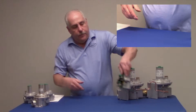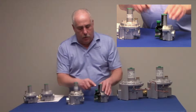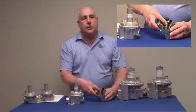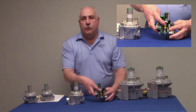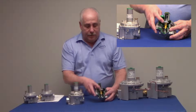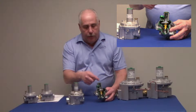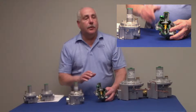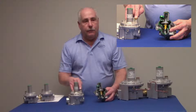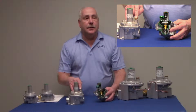The dual diaphragm, using either the external vent limiter or outside venting, gives you extra protection. If the first diaphragm ever ruptures, you have a second diaphragm with a small pinhole leak in it, which will allow the pressure to bleed off at a very safe rate. Remember, in Wisconsin, anything with our external vent limiter can be vented inside the building without having an external vent.